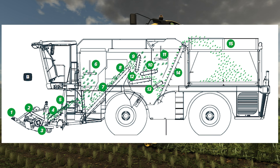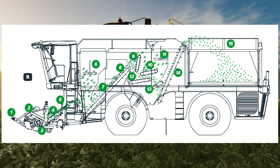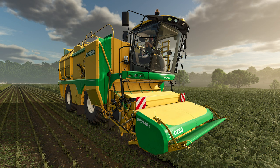On their way back up toward the top of the machine, the seed pods and other plant material have a second optional vine removal stage, before things move through an additional set of belts and suction areas to lift away more undesirable materials. Lastly, the cleaned bean pods are transported up the fourth incline conveyor belt, labeled 14 on this diagram, where they are then offloaded into the storage hopper, labeled 15.